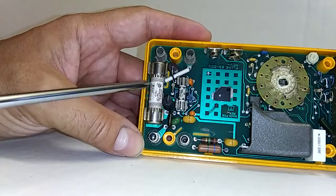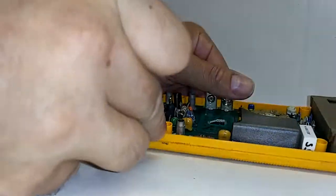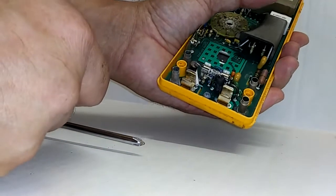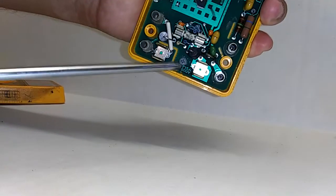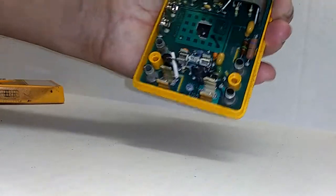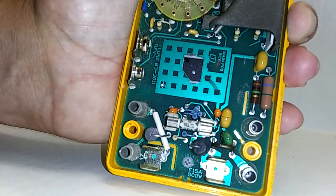I've removed the battery. We've got the little fuse here and the big fuse here — we want to get up under the big fuse. In these models they use the 15 amp fuses. Fluke's PCB boards are always labeled. Right here underneath next to the screw, it says F15 amp, 600 volts. That's how you can always determine what type of fuse you're going to need.